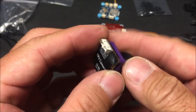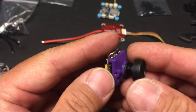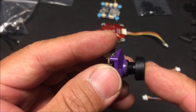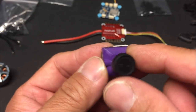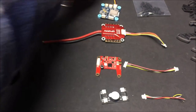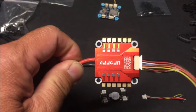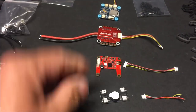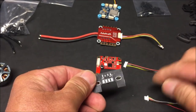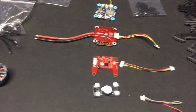Here's the FPV camera — it's made by Sky Stars, a one-third inch CCD camera, 600 TV lines, 2.3 millimeter lens, 130 degree field of view. I've used one of these before and they work great. We're also provided with the wiring harness for that. So the only soldering needed is the motor wires, the XT60 connector, and the LED buzzer light combo with its wiring harness.